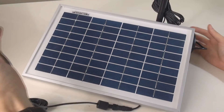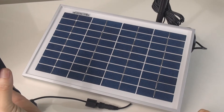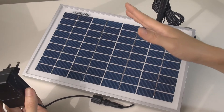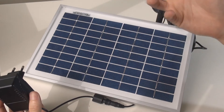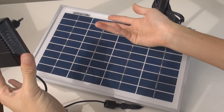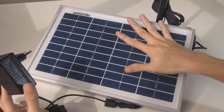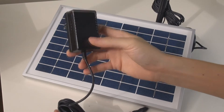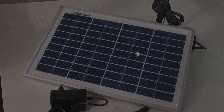You have power from the grid — TNB — and power from the solar. When the sun is strong, everything will use solar and the grid power will cut off. But if it's cloudy and the sun is not strong enough, you take whatever solar power you can generate and add on the grid power — maybe 50% each. Come nighttime with totally no sun, you draw 100% power from the TNB grid. In a short while I'll show you a live demonstration.